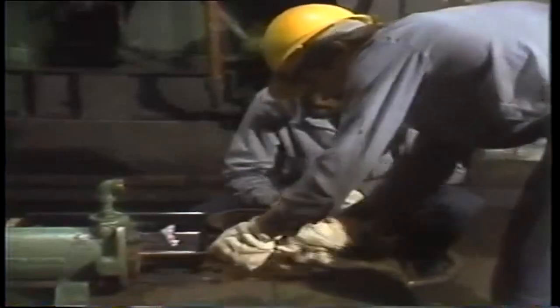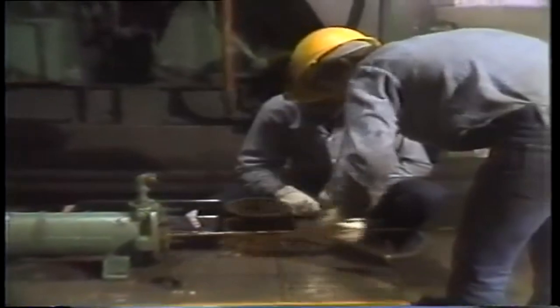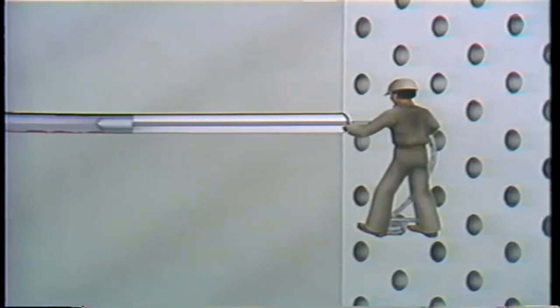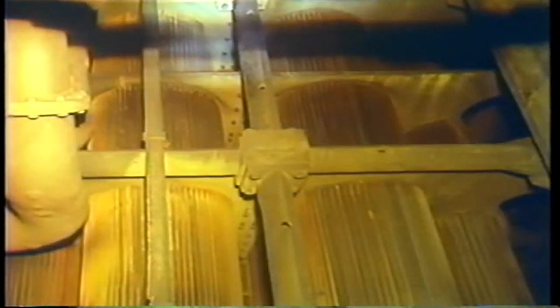It's the elbow grease version of shooting tubes and is practical on small heat exchangers like a small oil cooler. And there are also devices like plumber's snakes used to clean drains and sewers. They remove the toughest stuff with a rotating scraper on a flexible cable. In large heat exchangers, tube bundles can be pulled out so the outside of tubes can be cleaned. Corrosion, scale, and deposits can be brushed off with wire brushes.